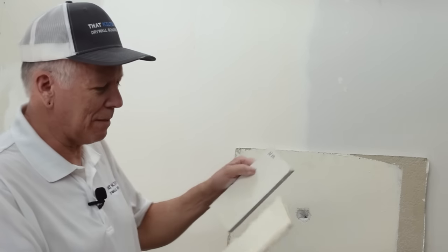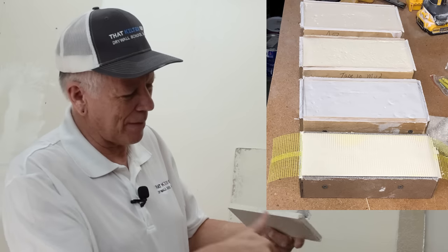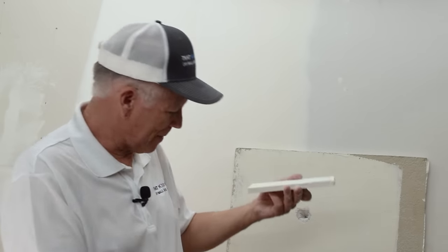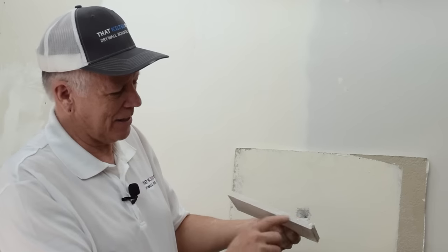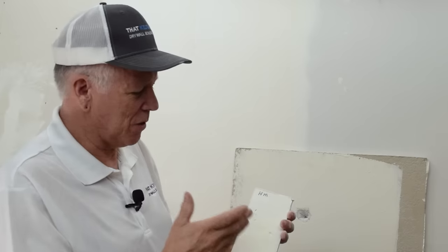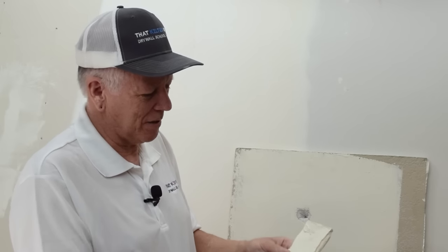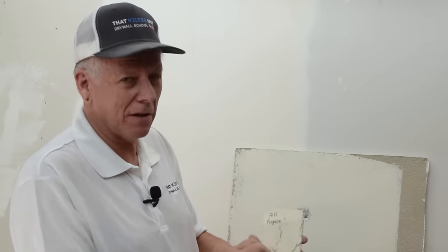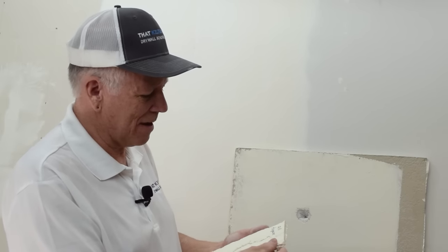Here are some samples I made up. I put these in a homemade casting block about a half inch thick — this is hot mud. Notice it's just one coat, I didn't smooth it out, it didn't shrink much, it dries smooth, and it's tough. For thicker stuff it's the only way to go. Compare that to all-purpose: you can see it's got a big crack, I actually had to glue it back together because it falls apart so easily. It's just so much softer — not good for deep stuff, only good for thinner applications.